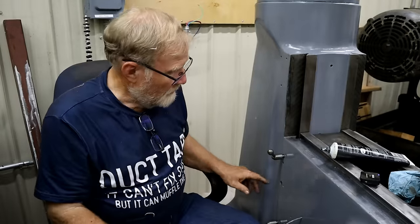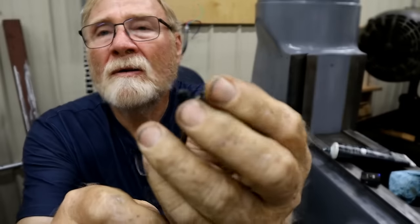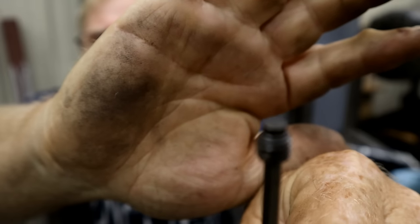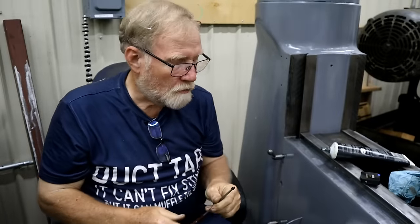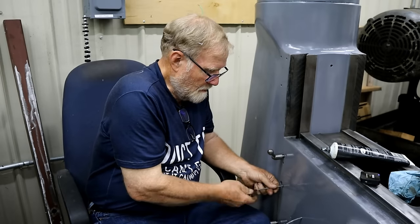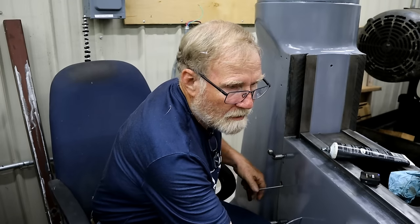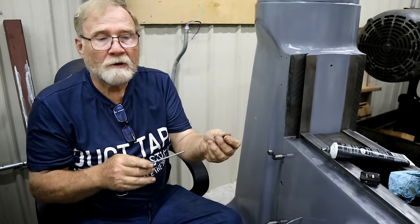Now, that rod I just put in, it's held in place by two screws. And they're different. One's just a plain old... That's a dog point. See how it's not threaded all the way to the end? That recess will go into the recess on the shaft. So it goes in first. You go in there and... It's tight there. Now, if you tighten it too much, it binds the shaft. So I got it right there where the shaft, that's good right there. And adjusting the shaft as I feel it. And then you put this one in to lock it.